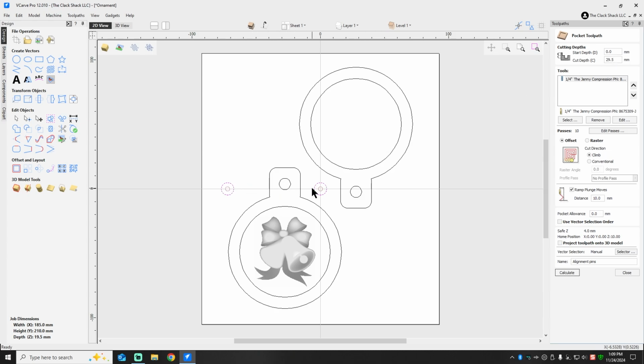And it hit me like a ton of bricks that if I put this in the center, when you rotate this, you've got to think of it as a 3D design. If I rotate this now, it's going to rotate on this axis right here. This line right here is the line it's going to rotate. Or if you do it the other way, it's going to rotate on this line. Now, if you're going to make it open right to left when you flip it over, you would want to put your alignment pins, like say here and here. You're going to want to run them on this axis as opposed to this axis.